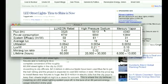Here is a comparison of mercury vapor, high-pressure sodium, and an LED light. As you can see, mercury vapor runs at 138 watts, high-pressure sodium runs at 90 watts, and the same lumens you can get from the LED is only 67 watts. From mercury vapor down to LED, that's almost a 50% reduction in watts right there.